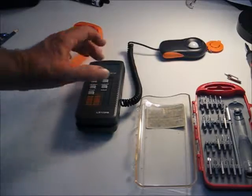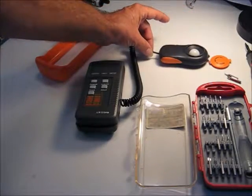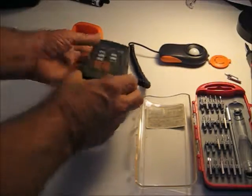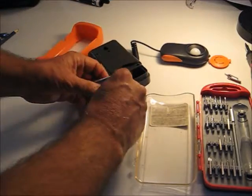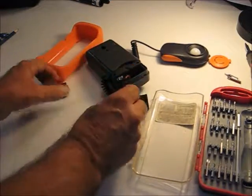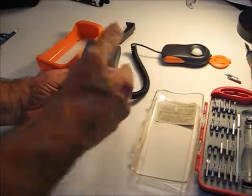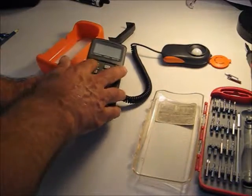Because we're on a little voyage of discovery, we're going to disassemble the head and see how many conductors there are and how it's connected in here. But the first thing we're going to want to do, because we don't know exactly how this critter works, is remove its battery — just in case there's some kind of bias voltage in here. There shouldn't be with it turned off, but why take chances?